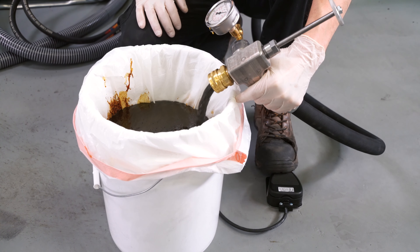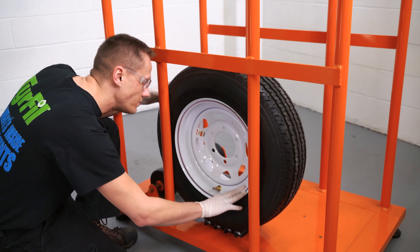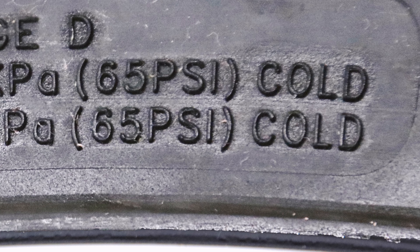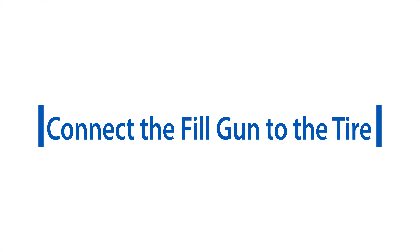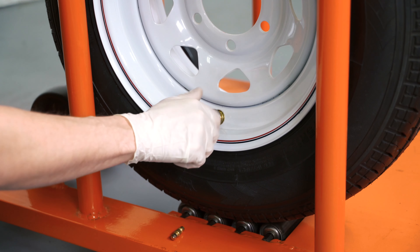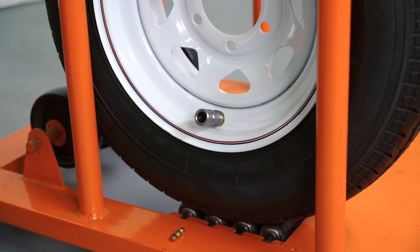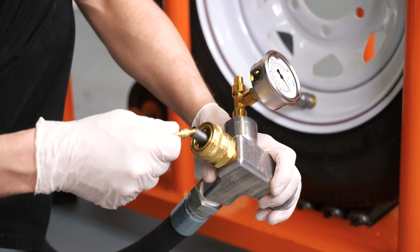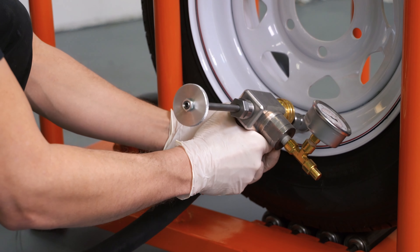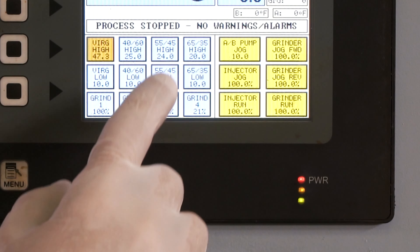Here we use the foot switch to run the machine. The tires should be safely placed in the tire cage with the air water valve in the 6 o'clock position. Verify the tire manufacturer's recommended PSI prior to filling. Remove the air water valve. Attach the gun connector to the base of the air water valve system. Press the air water valve into the gun and pull back on the plunger. Attach the fluid gun to the gun connector. Select the desired mix ratio on the AutoFill control panel, which is determined by the application for which the tire will be used.